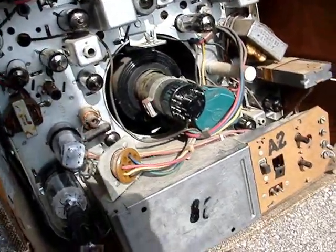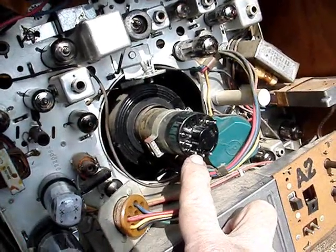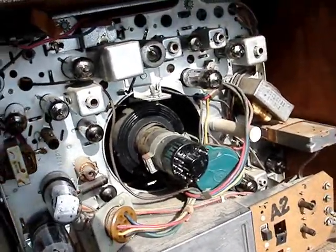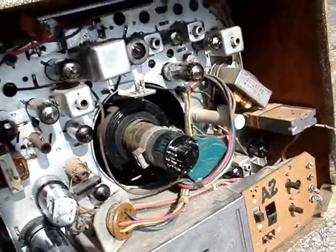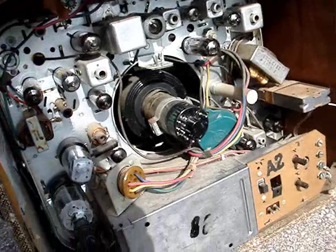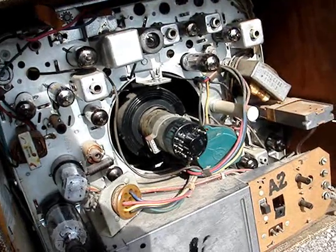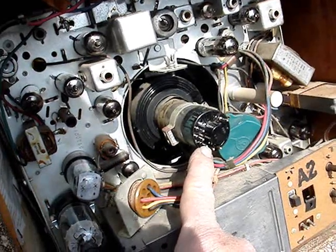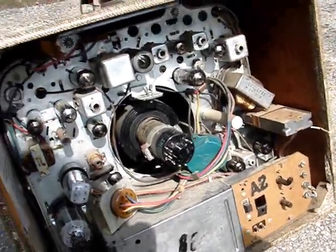I can't get the filament in the CRT to light with my CRT tester. The problem is the solder is bad on this pin. I'm going to bring my soldering gun out and just touch that a little bit. The trick is, technicians years ago used to crimp these, but you don't want to get it too hot — if the wire going through the CRT gets hot enough, it could crack the seal. So I'll do just a quick touch-up on that pin only and deal with the rest later.